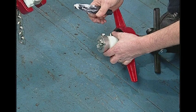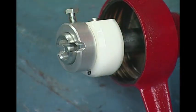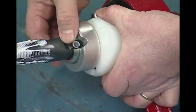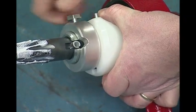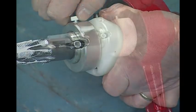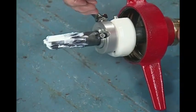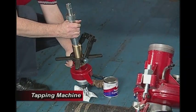Next, push the knockout pin in the boring bar to its holding position, which is toward the flat side of the bearing. The retaining bolt needs to be retracted far enough to allow the drill tap to seat properly. Insert the shank end of the drill tap and align the pin with slots in the bar end. Make sure the tool is securely seated and lightly tighten the tool retaining screw. Retract the tool end of the boring bar all the way into the top cap.